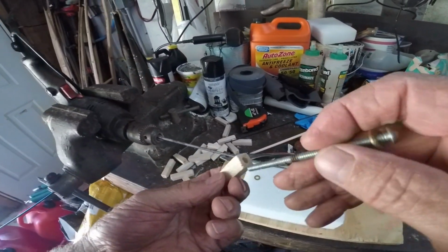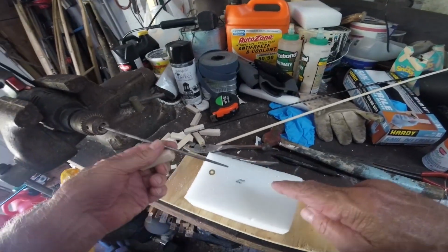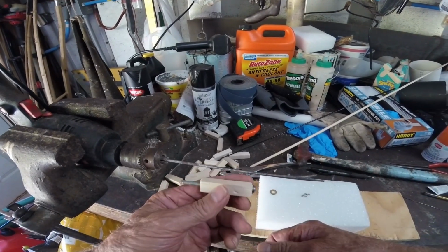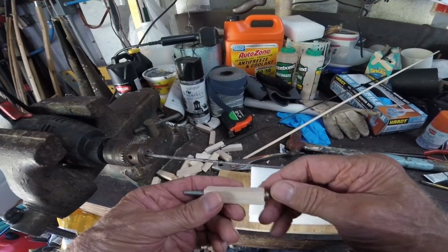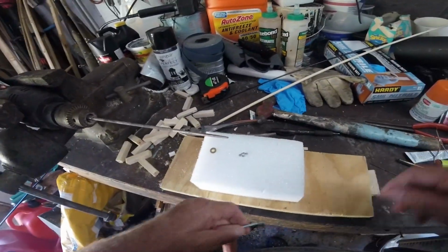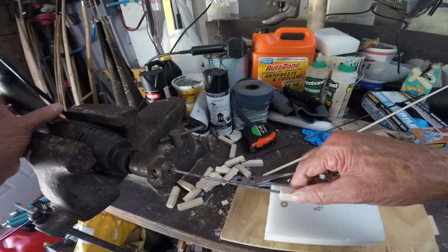All right guys, this chainsaw file is a different file than I had last season, and it's a little bit smaller diameter. So the hole needs to be big enough to get my mandrel through, to go onto my drill, so we can turn this thing like a little mini lathe. This one slides in nice, so we'll put that over here in the good pile. We'll grab this one here. See, it's really tight. Let's grind her out until we get it right.